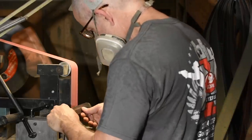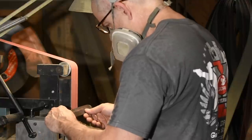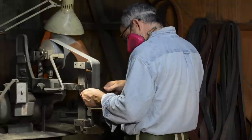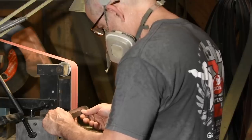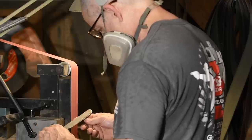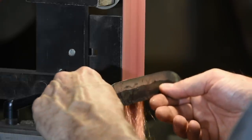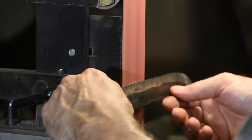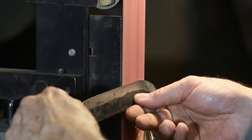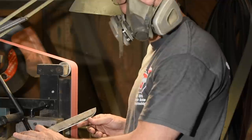Side two leads me to the king of the knife maker's shop — the belt grinder. If you get serious about knife making, you'll end up with a 2x72 inch belt grinder similar to this one. The 2x72 inch grinder is absolutely the foundational tool of the serious knife maker's shop, but even a cheapo 1x42 inch grinder from Harbor Freight will be faster than using files. I'm using a 40-grit ceramic belt here. The cheapest belts are aluminum oxide abrasives, but ceramics like these Combat Shredders, while a bit more expensive, last so much longer that I almost never use aluminum oxide anymore for heavy stock removal. I grind the edge down to about 15 thousandths of an inch thick — maybe half the thickness of a dime.